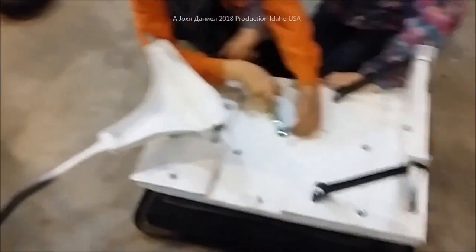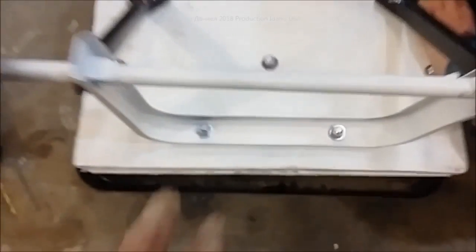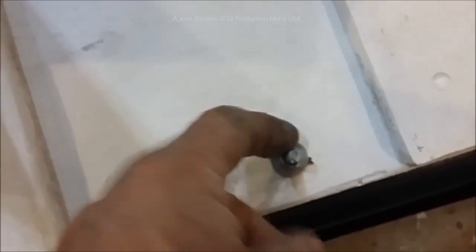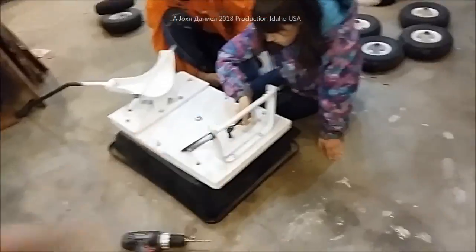Now we've got the plates all put together. We've got the front steering assembly. Everything's been painted with a prime coat and they are putting the carriage bolts in from the bottom up, going through this heavy-gauge plastic tub. The bolts are working through all the layers and they're on the last few to secure the tub and sandwich all the wood together — three layers of plywood. We're using Tacoma screw box bolts, two-and-a-half inch, to go through everything. We'll cut the excess off and use lock nuts on all of it. Then we'll put the tires on, paint what we forgot, and paint over the bolts too.